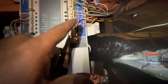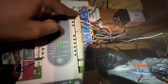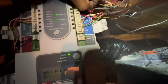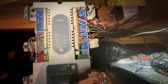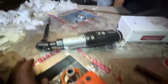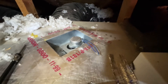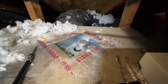Wiring is complete — let's take a look at the panel. There is the zone 1 damper right there. Right now it only has common and close — M1 and M6. There's an M4 for open. Looking at the zone 2 damper, I have connected white for the common, yellow for the open, and red for the closed position. Zone 2 is all done and works great. I'm moving on to zone 1 which is downstairs — I'm going to remove the Synchron motor and the holder as well as the set screw and get the new one in place. Hopefully it doesn't take more than half an hour.